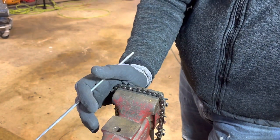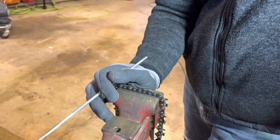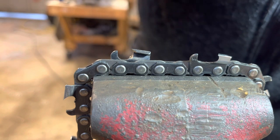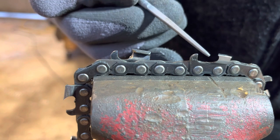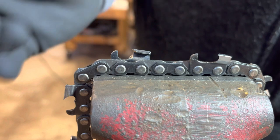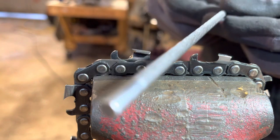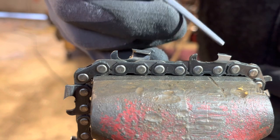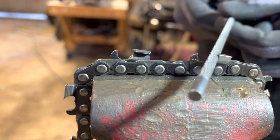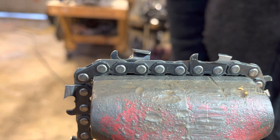I feel a little obligated to make this video — I've waited years for someone else to make it, but no one has, so I'm going to make it. So put your thinking cap on if you're new to this game. Step one: a properly sharpened tooth. This section right here is the gullet, and it's properly sharpened. To get it properly sharpened, you simply take your chainsaw file, set it on the tooth, look at this witness mark right here, and file accordingly. It's that simple. We do not need to over-complicate chainsaw filing — it's been engineered to be very simplistic.